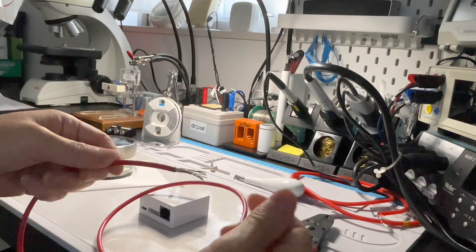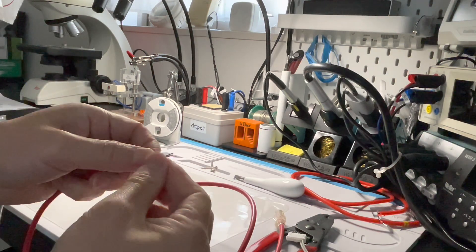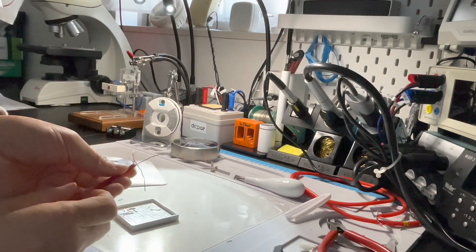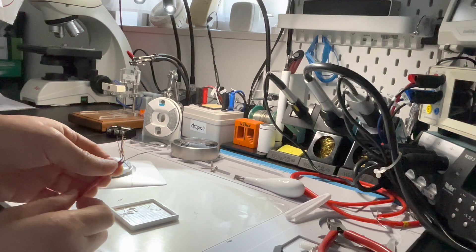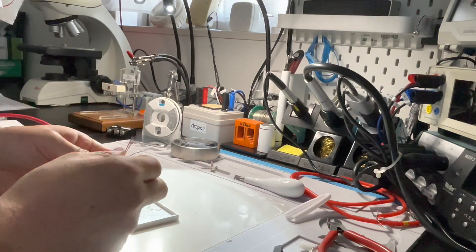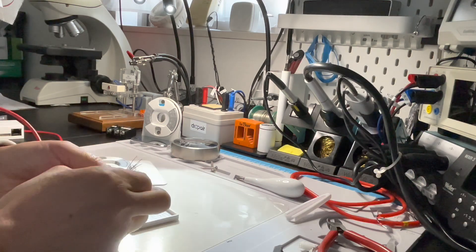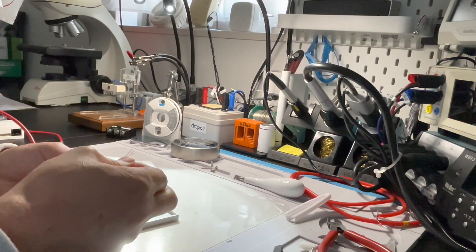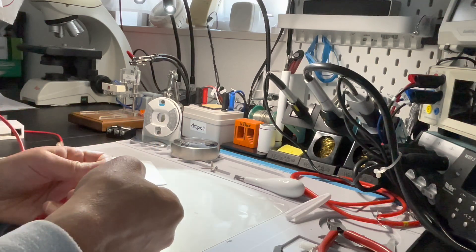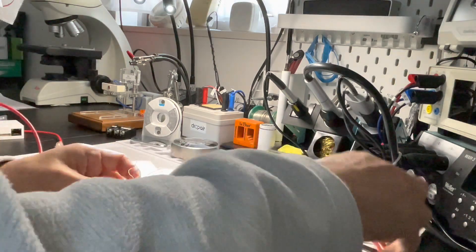After you cut it, we need to take the wire screen and the plastic protector out. We only need six wires, so the orange and orange-white wires do not need to be used — we can cut them off.